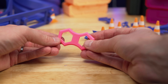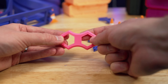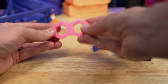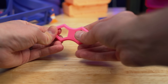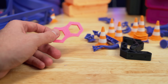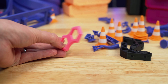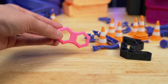I did some testing of more difficult filaments. This pink is a flexible TPU — a really great test because it has to make sharp corners inside. It is really difficult with soft TPUs to get nice sharp corners, and this small print can be done in only 10 minutes. It's nice and strong with no layer separation. I would recommend putting some glue stick on the build plate to help the part come off, as this was really difficult to remove from the PEI build plate.